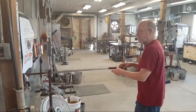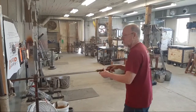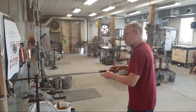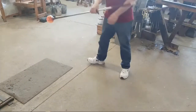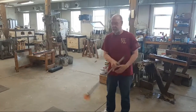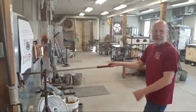He actually over-inflates it just a little bit, because when he begins to elongate this by swinging it or letting gravity draw it downward, it will necessarily become narrower. By inflating a little bit beyond what he wants for his finished diameter, he can now lengthen the vessel and end up at the right diameter. By angling it down, it starts to fall from gravity — some gentle swings back and forth — and he treats us to his airplane propeller move. You can see from the elongation that he did that very gradually.